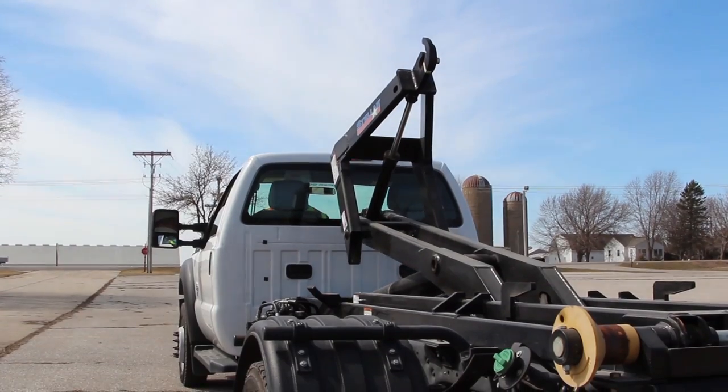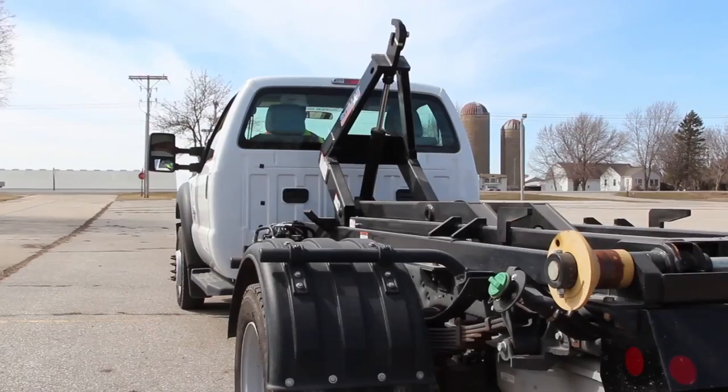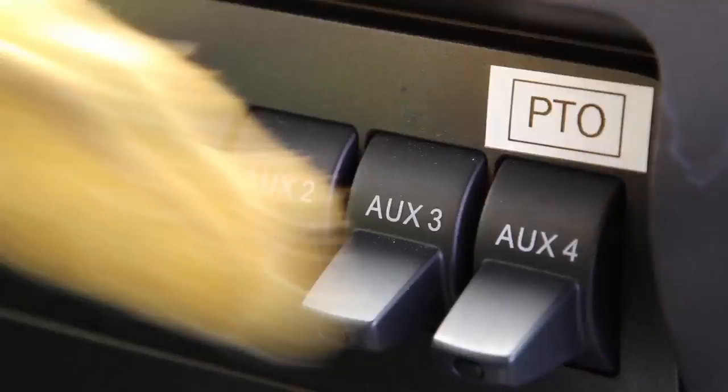Once fully detached, push the lift control lever until the lift returns to the loading and unloading position. Finally, push the control lever labeled tilt to move the tilt forward until the dump tabs fully engage, then disengage the PTO.